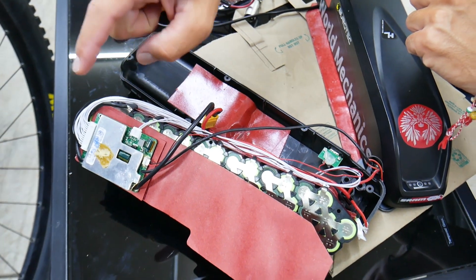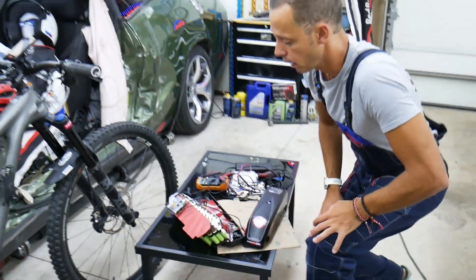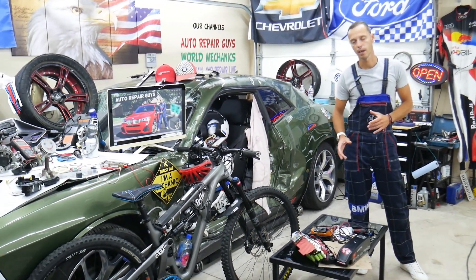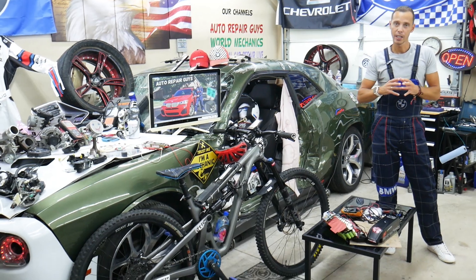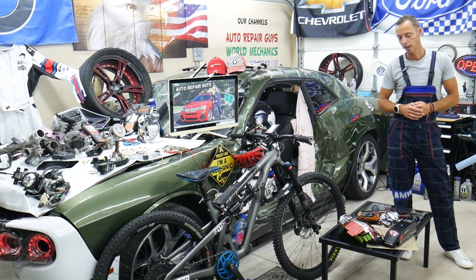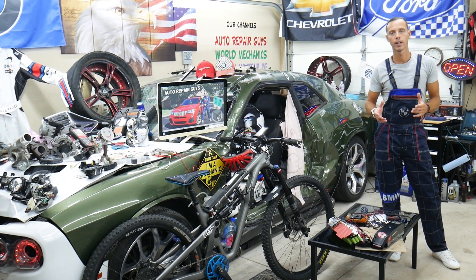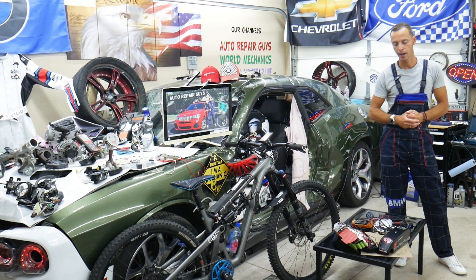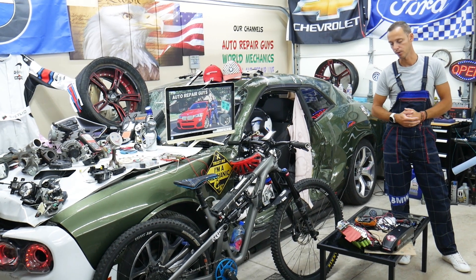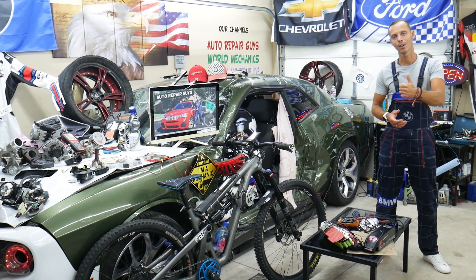What causes this is a bad battery monitor system — the BMS. It could be a bad battery itself, but most of the time check the BMS first. All battery voltages should be really close together, and if they deviate you have a problem. If more than two batteries show lower voltage, that whole section is likely not being charged correctly by the BMS — the batteries themselves are probably fine. All you need to do is replace the BMS and you're good to go. Hopefully this video was helpful — thanks for watching, see you next time.